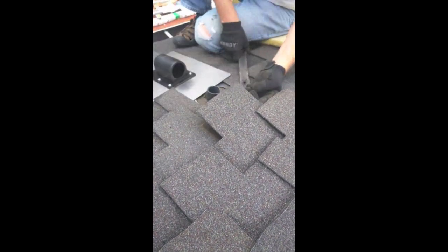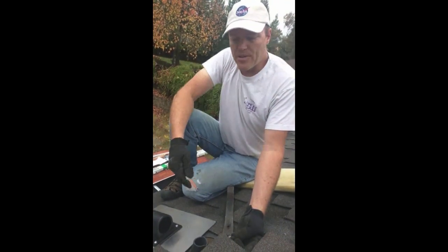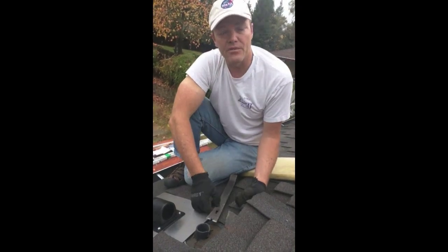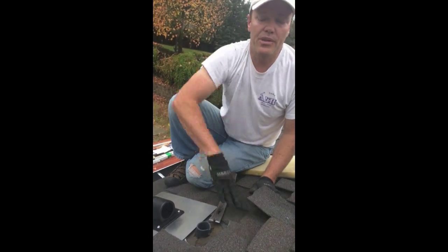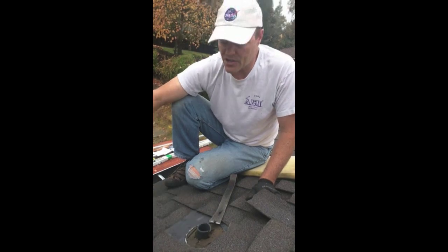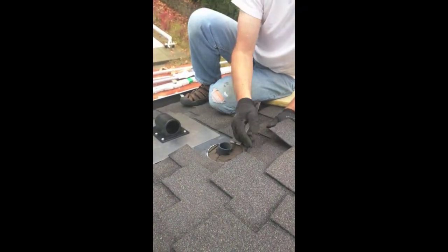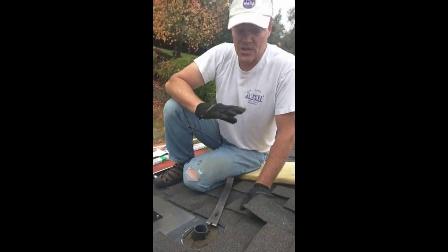You could just hammer them in, right? To hammer them in I would have to pop them through this layer of shingle, creating a hole, and then hammer them in — or, having pulled that nail out, I can pull up the layer it was going through, put the nail underneath, seal it, and put a little sealant on top of the hole. If I had removed the original flashing, the problem would be a lot worse, because that existing flashing is bigger than the Solar Roof Jack flashing and its nails go all the way across the top — those would be very difficult to remove and put back.